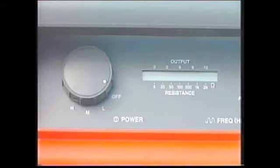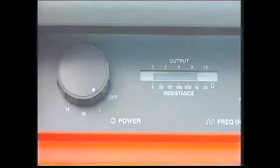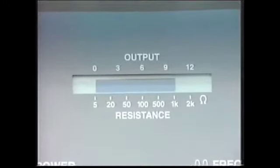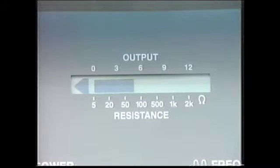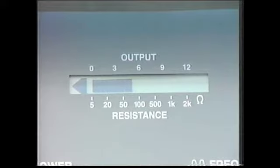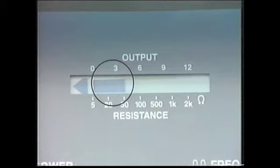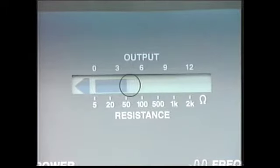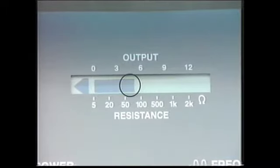After connecting the ground, turn the transmitter on by again setting the power knob to the L or low position to minimize bleed over onto unwanted conductors. The transmitter again displays the battery check, then tests frequencies if in the auto mode. Once a frequency is chosen or manually selected, the transmitter then simultaneously displays signal strength and the loop resistance of your conductor. Solid bars indicate the signal output strength. The position of the blinking bar indicates in ohms the resistance on your conductor.